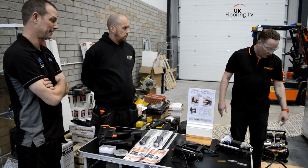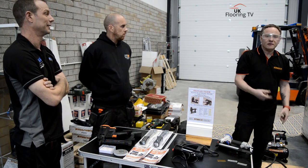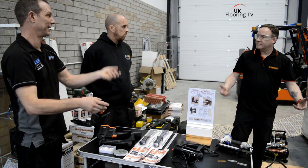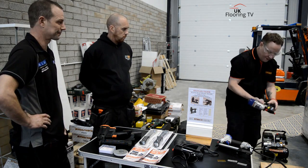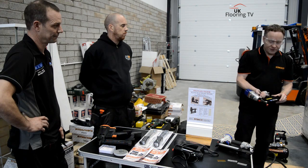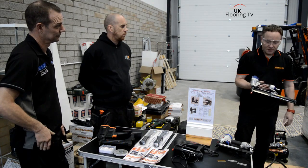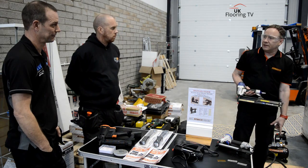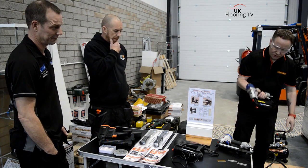A lot of people, in our experience, buy the gripper with the nails already in because it's cheaper. And it's even quicker — they just go around, put it in with the nails in, run around, put the nails in their pots, and never have to buy a nail. So that's the LT50. What we would say is it used to be a 20mm nail that goes into the concrete, but you can use 20 or 25s. If it's a 20, it goes in only half an inch — 12mm — into the concrete and it's solid. You're not moving that.